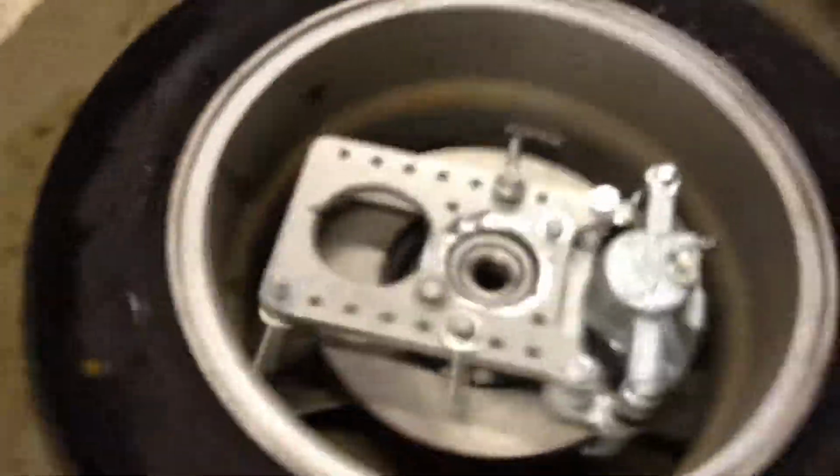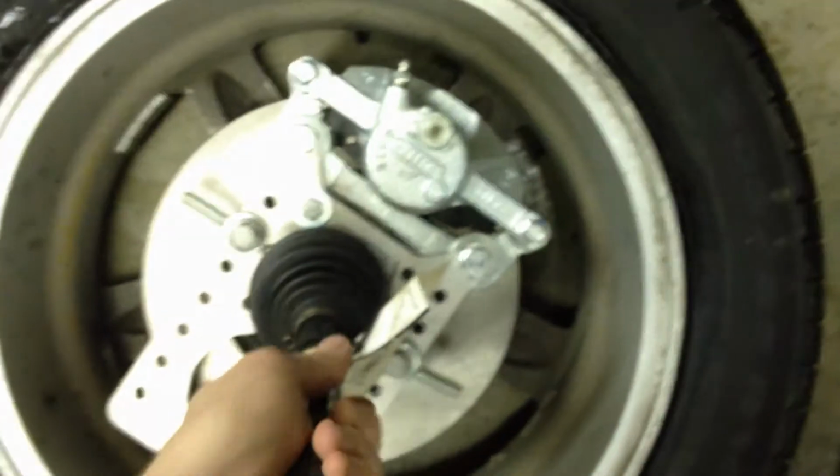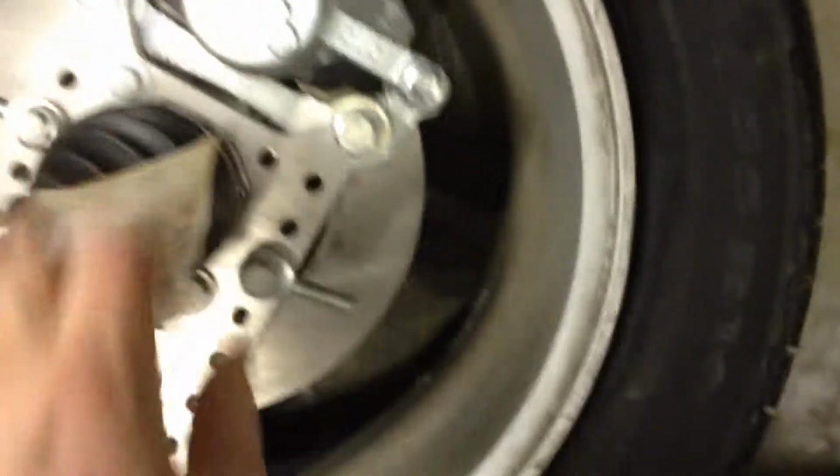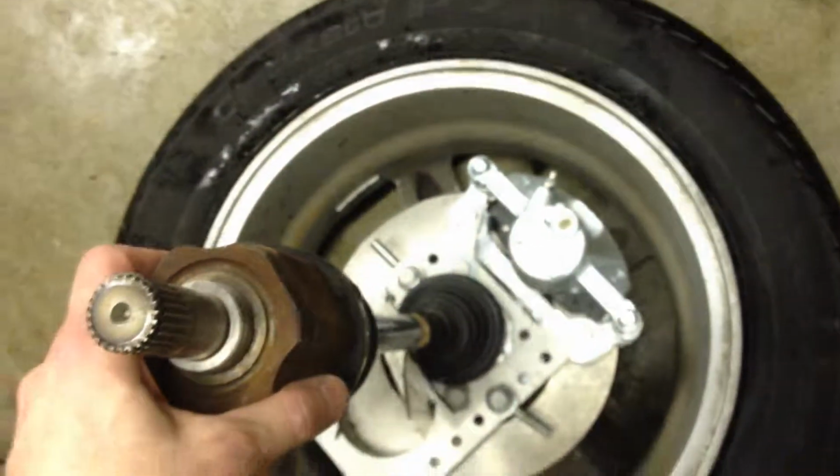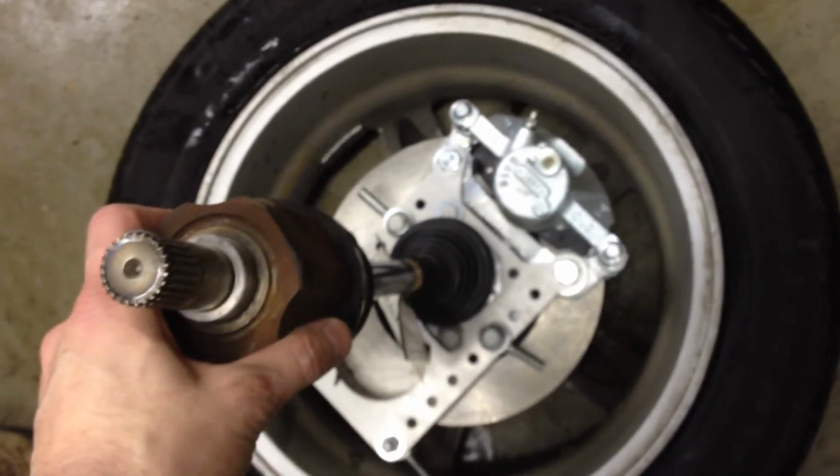And the drive axle, here is the short end axle from an R18A engine. And so this is a Civic knuckle. We just happen to be using an RSX wheel. Slides in perfectly. You can see we've had to recess to clear the plate, and our drive axle fits in the modular knuckle assembly. Success!